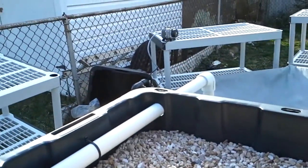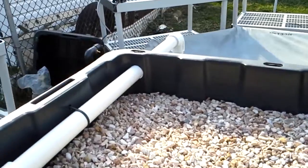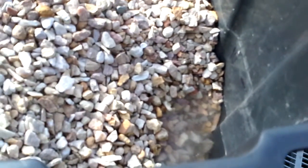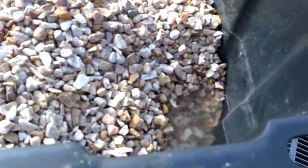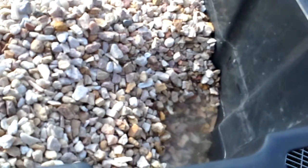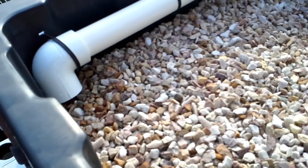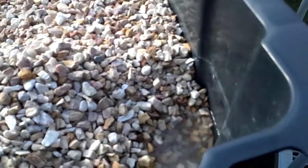The plan is to run each grow bed off of its own 18 watt pump, so that I can have some redundancy there in case there's a power failure. I also have battery backup — probably one battery backup for every three grow beds — so that if power goes down, the pumps will keep operating. These pumps should also provide aeration at the same time as pumping the water out of the fish tank into the grow bed.